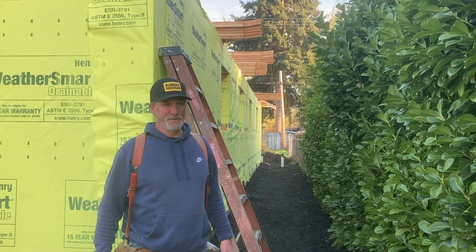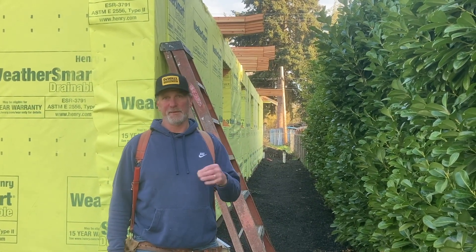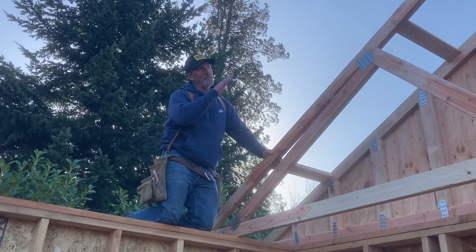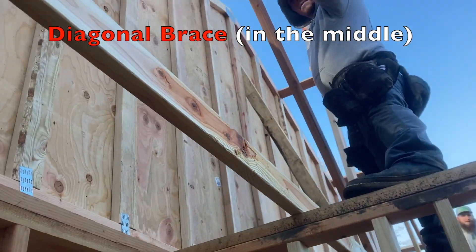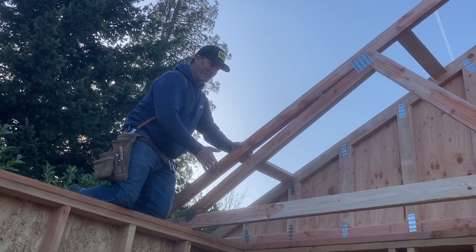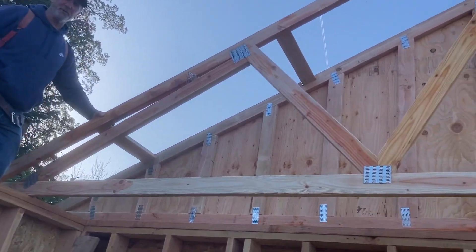It's not always appropriate to run a string line — if the wind is blowing, the string blows too. I get it as tight as I can. It's morning, it's calm, it's a perfect time to do that. Conditions may warrant doing it some other way, but when you can do it the fast way, I'm all over that. We had to put a brace on this gable to get it up without it falling off — a little diagonal brace — but I was mindful to keep it clear of the first truss so we don't have to knock it out of the way.